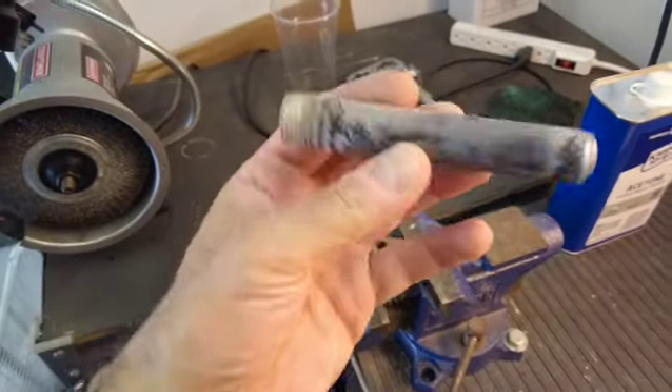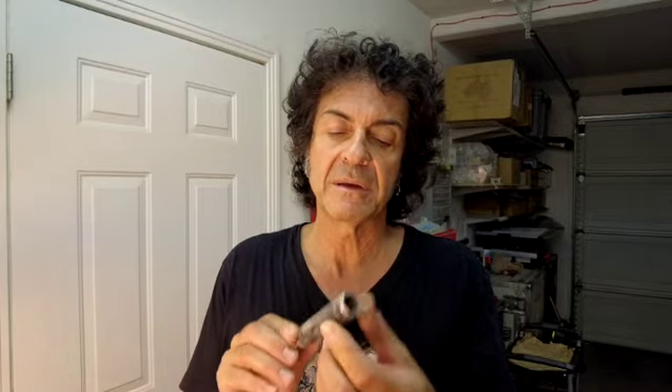So that is not going to work, so what else can you do? Well, we need a piece of pipe which has the correct internal diameter — which in this case is half an inch — and it needs to have the NPT threads already cut into it, because as we've seen we don't really want to have to cut them in. Either it's going to be very difficult, or in the case of this alloy, by the time you grip it tight enough you're going to crush it. And the obvious thing that came to mind was black pipe used in construction to carry gas around a house — but that is very, very heavy metal, it's overkill. So all of a sudden I remembered there's another place where you can find pipe with NPT threads, and that is in the irrigation part of your hardware store.